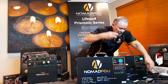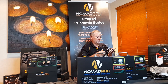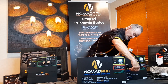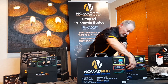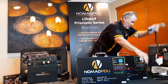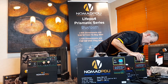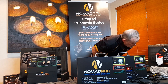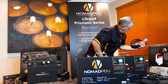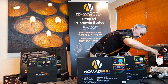These are the same chemistry so I can loop them. This DC-DC takes 9 to 36 volts in — so at 12 volts in that's no problem. At the other end it puts out 14.6 volt at 10 amp. I plug this into my SIGA socket — that's now charging — and then I plug the 14.6 regulated output into the L series regulated input. These L series are 50 amp in, 50 amp out.